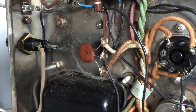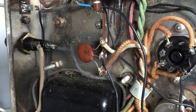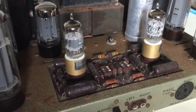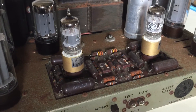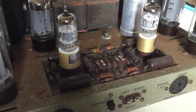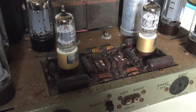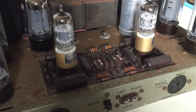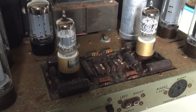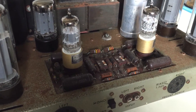I tested this one and this capacitor appears to be okay, so I found no need to replace it. It is important to note, however, that you should be testing this capacitor. While we're discussing some components and their operation in the circuit, I'm going to talk quickly about resistors, and I'm going to mention this only once. People talk about different types of resistors and audiophile grade resistors and all that — the fact is, as long as you're using the right resistor within tolerance at the right wattage, we are not nearly at the frequencies where the reactance of the resistor would play any issue with regard to the output of the amplifier.